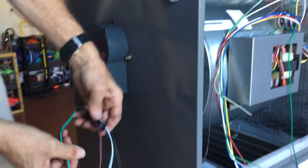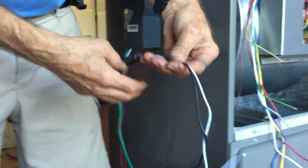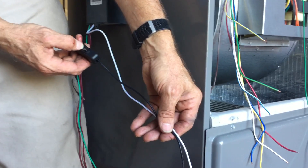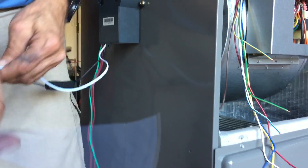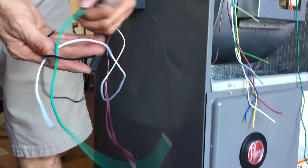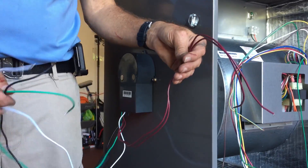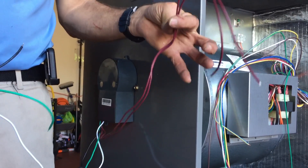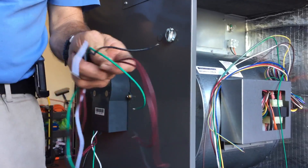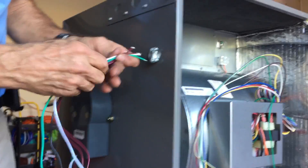All I did here — I drilled the hole and put a half-inch Romex connector here. This is where you hook up your line voltage on the high side, and it actually has an inline fuse so if something happens you can turn it on and off. Here's the ground, and these right here are for an annunciator switch. If the owner wants a light to verify it's working in the hallway or next to the thermostat, you can hook this up — you'll buy that from your local HVAC supplier.